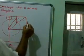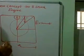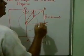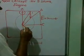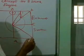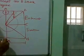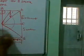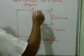This will be the exhaust phase. Exhaust will start and again, up to point C, there will be an exhaust. Further, it will go and it will be a suction slot — from C to D, this suction slot comes in. Afterwards, from D to E, it will again be a compression slot. And after combustion, it will further be a working slot as shown here.